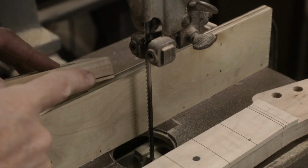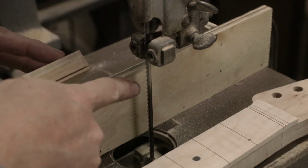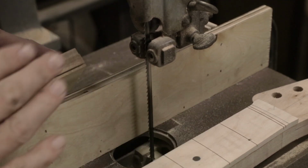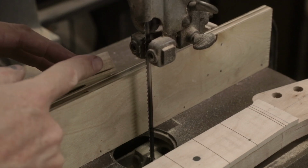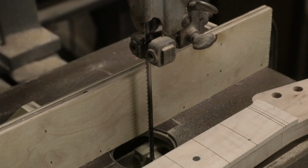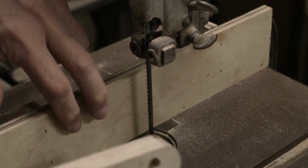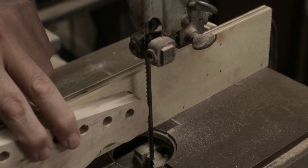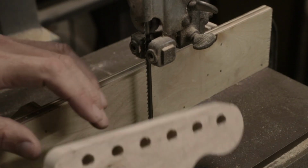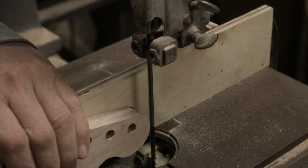And this was my test block for here. I took my calipers and measured. It's at 590, and we really want this 550 at the end. So I've got to take off about 40 thousandths, and I'd much rather have this proud than too shy, because you can't put wood back on. You can, but you can't. We're just going to go really slow, making sure that we have pressure against this fence at all times. And then when we get to our stop mark, we're going to stop a little short. I may finish this by hand and then cut across here to get this piece loose.